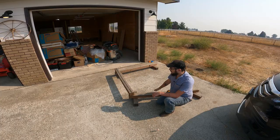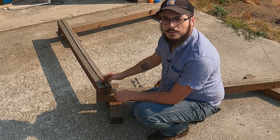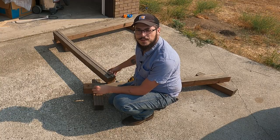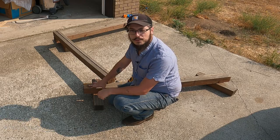This is what we're working with right now — it's just a very simple balance beam. The person who originally built this used lag-type screws. This introduced some splitting without the use of a washer, and it didn't go all the way through the bottom side, so they pulled out over time.